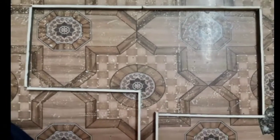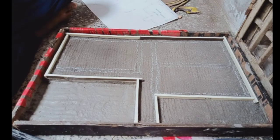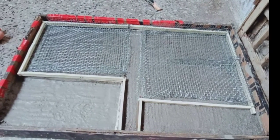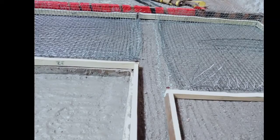Then for the base, formwork was created. We marked out the center line and placed suitable reinforcement. In this case I added steel wire mesh from the nearby hardware stores. And off we go to prepare and place the concrete in it.